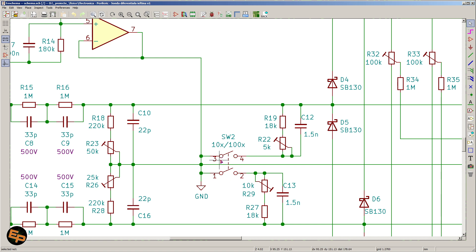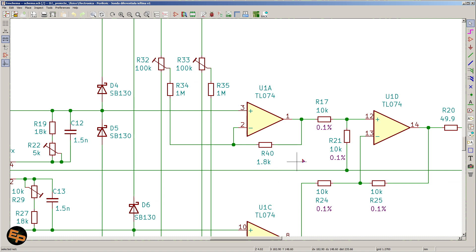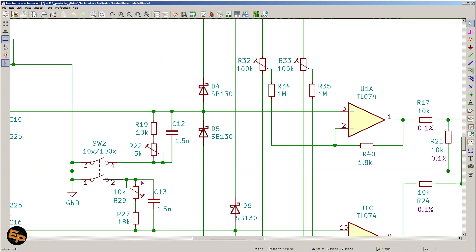We're looking at the blue graph, not the red one — the red one is the phase, but we don't care about that. Looking at the negative circuit, we see an almost identical response. The differences are very small — going back and forth between them, these two circuits are pretty well matched, at least in my case. Doing the same frequency response analysis but for the 1-to-100 attenuation ratio, we also see a more or less flat line of minus 40 decibels — which means 1-to-100 — up until the same 1 megahertz. It's true that it's not as flat as for the 1-to-10 ratio.